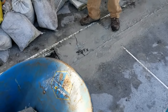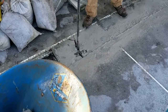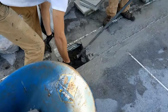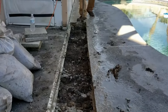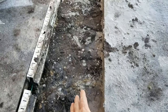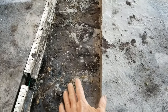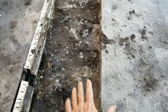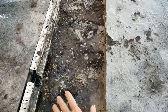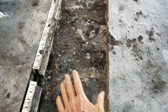If for some reason that concrete doesn't crack, keep hitting it in the same place over and over, just like the jackhammer, and of course if you have a hammer available you can easily use that if necessary. A couple of barrels of concrete have been removed — when you clean out your trench for the channel drain, it's not much deeper than the grade; it's designed to sit inside the concrete and is only four or five inches thick. Do not remove too much soil, because if you do you're going to have to put it back in order to lay your channel drain.